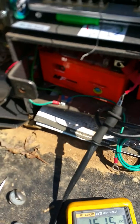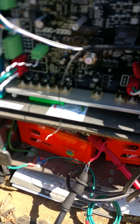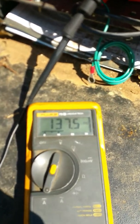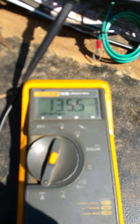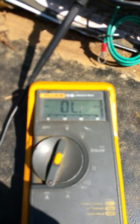There is a photo sensor — I connected it but it only activates when the operator comes on. I'm going to give it a close command here, and it's reading 136 milliamps and then it overloads.